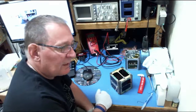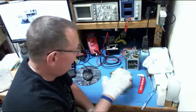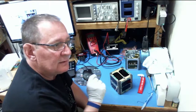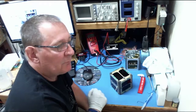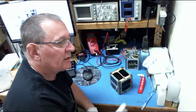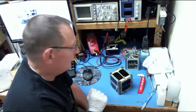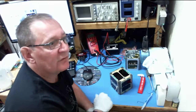So starting up hopefully tomorrow, at least for sure Monday, we'll do some tests. First we do some tests on RadFxSat that are designed to look at it in this launch configuration. In other words, in the P-pod in a sense. Is everything shut off? Does the IHU operate through the umbilical and diagnostic mode? Or do the antennas show stowed? Do they not deploy when you pull the RBF pin and such like that?